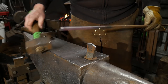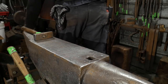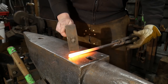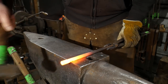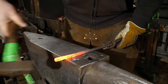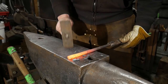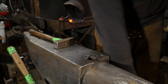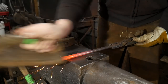Before we cut, I'm going to show you the easier way of doing it. We're going to heat this piece back up, and while it's heating I'm going to adjust my half inch material. Whenever you're doing a collar weld you want to make sure that you pre-upset the material first. This material is now approximately five eighths of an inch thick — we'll call it five eighths, or 16 millimeters for easy math. We've got the area upset and significantly thickened where we're going to do the collar weld, because you will lose some material thickness as you make your weld.